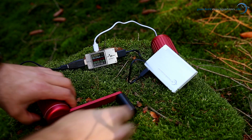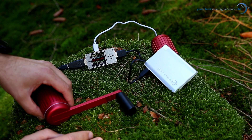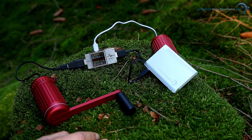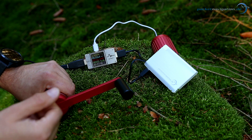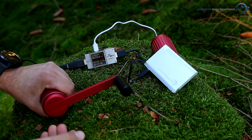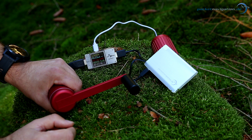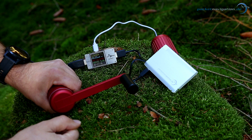I've connected a little power bank with a maximum charging rate of 1 ampere. This is important as a power bank isn't the same as a smartphone, which regulates incoming current — a power bank charges at whatever its maximum capacity allows. So if it's a power bank with a 2 amp charging current, it might try to absorb that amount from the hand crank. If you turn fast, you can achieve considerably higher energy generation than 1 ampere, which is what the device is designed for — even if it says 2 ampere on the packaging. But this device doesn't have a current cap, so if you turn the crank hard you'll be generating a lot more than 1 ampere. I managed to break 2 hand cranks by doing this.